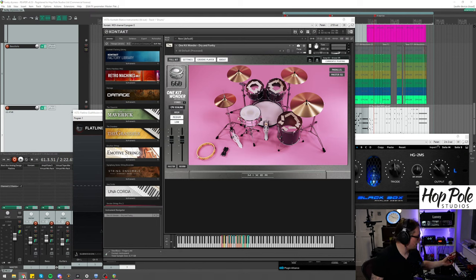The really long way thing doesn't matter if you're at home, but the without any noise bit is really important because the circuitry that's converting the guitar signal, or whatever signal it is, whether it's keyboard, bass, whatever, into something that resembles a microphone, in even some of the best small interfaces, it's kind of an afterthought. It's a secondary thing. And if you start adding things like virtual guitar amps, which distort everything really heavily because that's their job, then suddenly all that noise floor comes up and up, and the way to do it is to keep this whole part separate and away from the bit that's trying to talk to a computer in the same box. That isolates this, so it's not near any digital signals at all, and then it's fed into the interface as cleanly as possible.